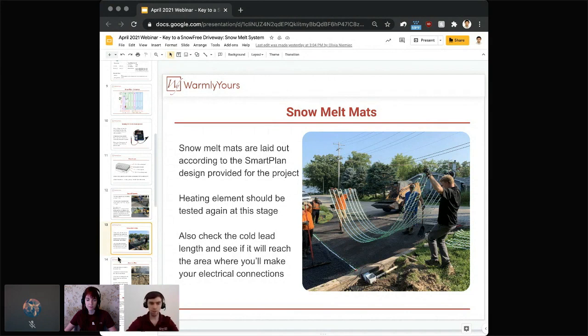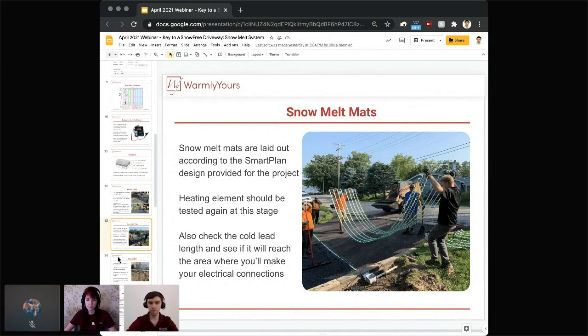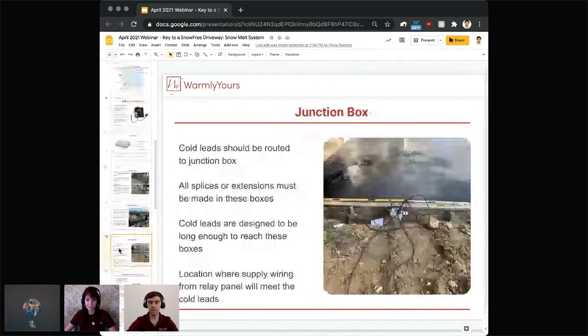So while we're talking about the junction box, I'm going to jump into my next slide that shows that a little bit in detail here. So eventually, you can see we're jumping a little bit ahead with the picture, because everything is now covered and all of the leads are ending up in this junction box. This is where the electrician will eventually get these leads extended and run with his own wire all the way to that indoor location where the power source would be.